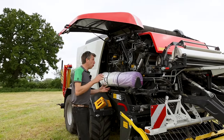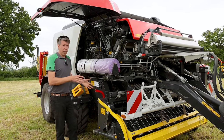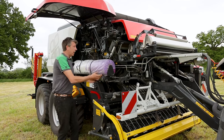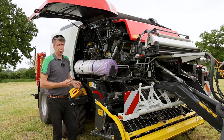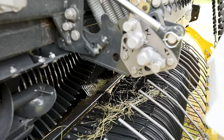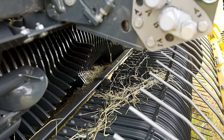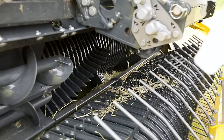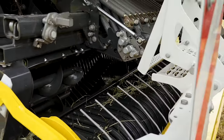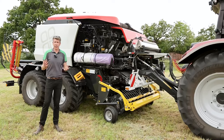If we get a blockage in the machine we call it a sunroof. With a lot of balers there's a trap door — blockage comes through, you lower the door, clear the blockage and away you go. On ours, because we work the other way around with our lift-up rotor, we have this whole sunroof system. The same principle applies: blockage gets into the machine, lift up the sunroof, once the knives are released clear the lump, close the sunroof again, insert the knives and away you go. We have a centrally suspended pickup — that's where it pivots from — which allows our pickup to really react to any lumps, bumps or undulations. We've got a travel of about 120 millimetres, so the pickup follows ground contours brilliantly. That was a very short insight into our Pottinger Impress baler. If you want to know more, please feel free to contact Pottinger or Border Plant and we'll be able to help you with your inquiry.